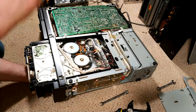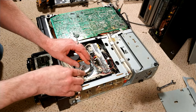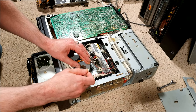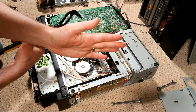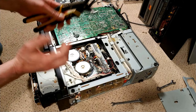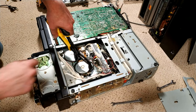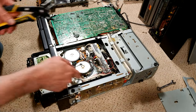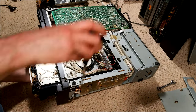And the other thing I have done as well, another bit of a tip here, is I've undone this nut already. I've undone it in the machine. It's a 7mm. I've just used a spanner. Probably a box spanner would be better, but the spanner's done the job. What I've done in this case, because it hasn't got the slots in the top of the shaft that the heads, well, the whole assembly sits on, I've actually used pipe grips very, very carefully. They're straight across where the nut is. You don't have to hold it terribly tight, it's just enough to get that nut undone. And it's loose, so yeah, that's another thing that might be useful. So stick my hand under there.